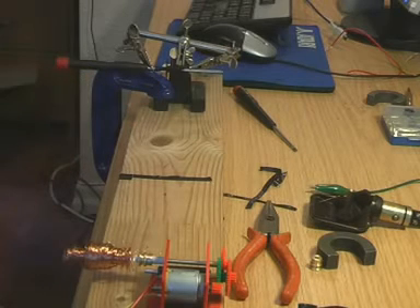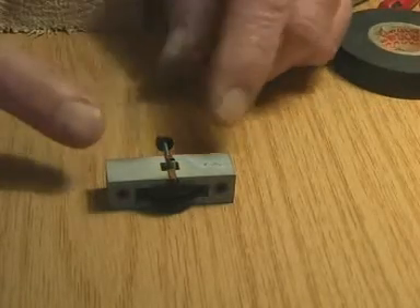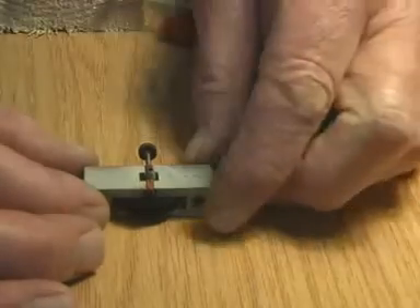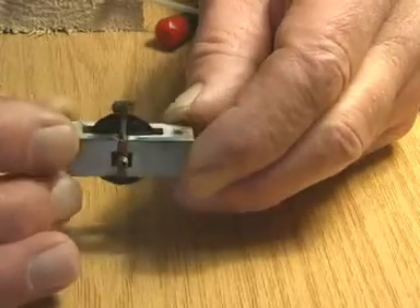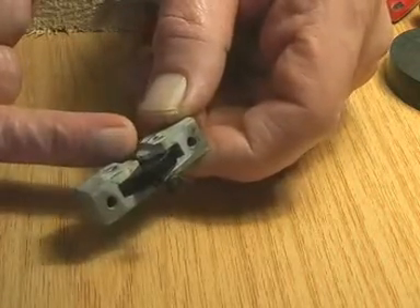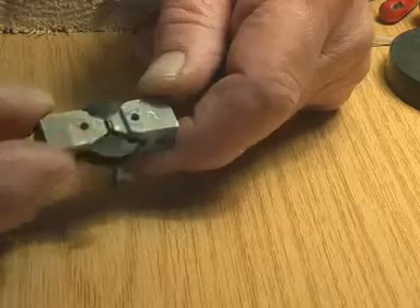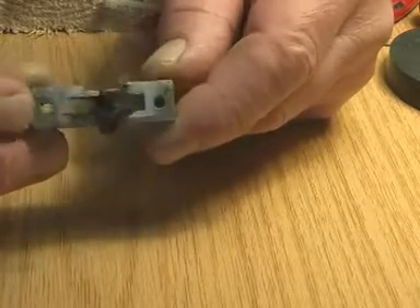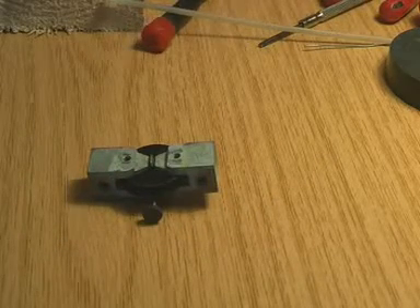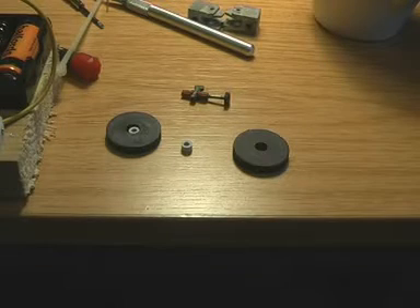Back to one empty former - stage two. Here's a close-up of the sub-assembly which has the two pole extension pieces, the armature, and the coil former all in place. You can see the little red rubber suspension, which doesn't appear to be in too bad shape, the hole for the needle, the needle securing screw, and the top of the armature coming up between the pole pieces. The former has gone in flat, but we've got to keep it that thin when wire is wound on it - unfortunately we won't get as much wire on, so the DC resistance will be lower.